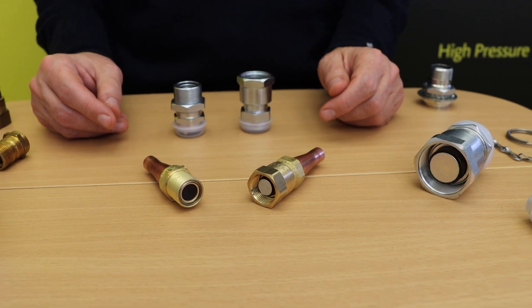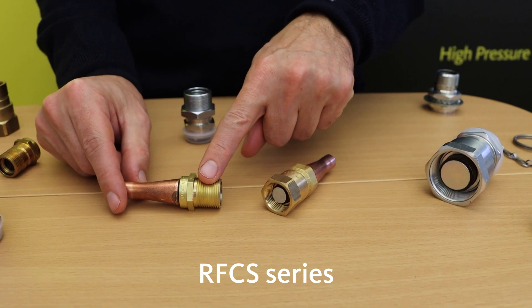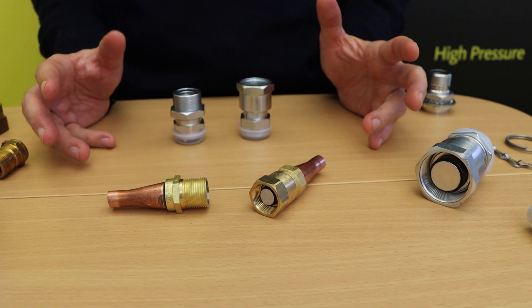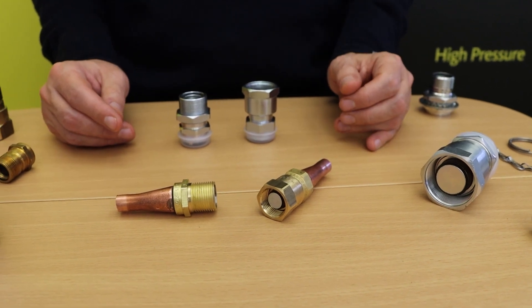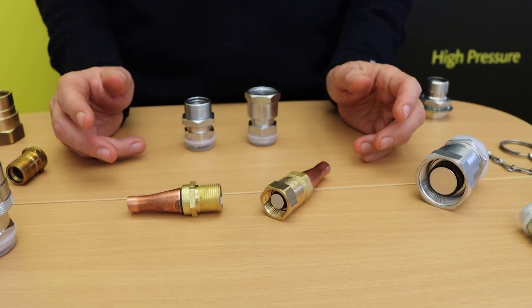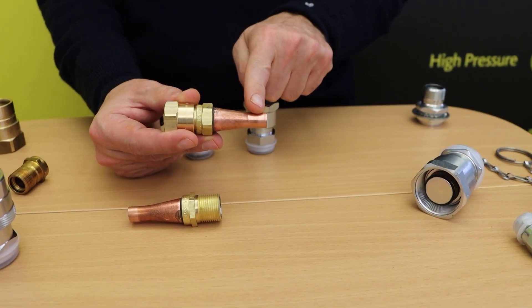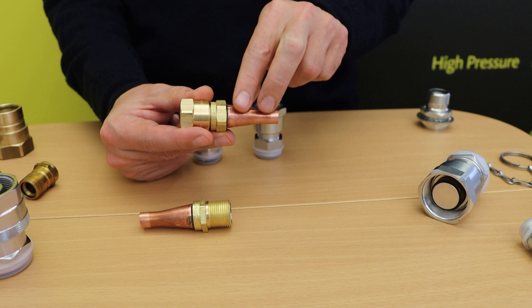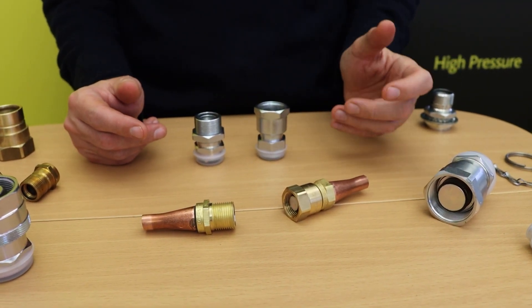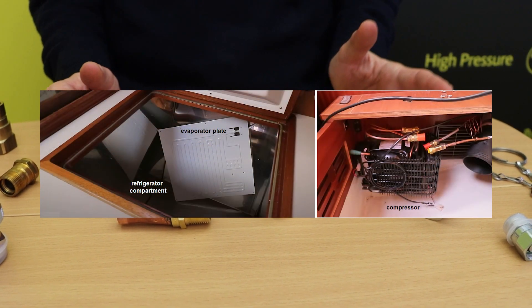Another interesting series is RFCS, which consists of brass couplings with integrated copper-steel adapters to allow brazing directly to the copper tubing. Benefits offered by this solution are a quicker installation and reduction of potential leaking points, as there is no adapter between tubes and quick couplings.